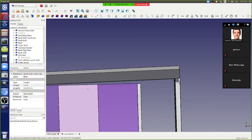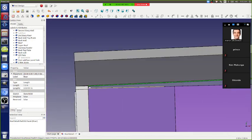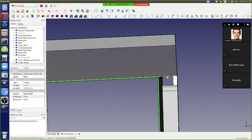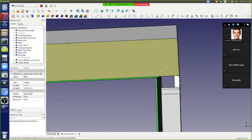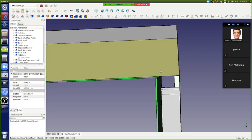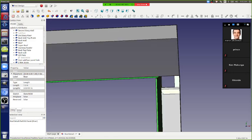And you also have hurricane ties at the front. On the back, we probably also want to do hurricane straps, so straps that go from here to the bottom panels. You've got to protect for uplift. So the standard is you do hurricane ties. We'll probably put the hurricane ties right here, spanning from here to the bottom panel, to the actual framing of the panel, which ends here. So that's what we need to do there.